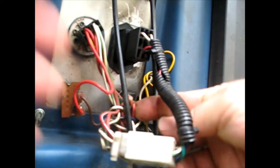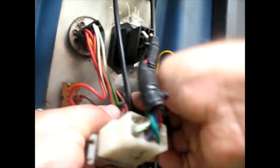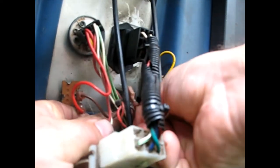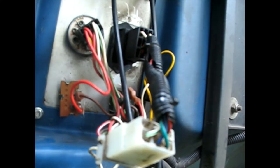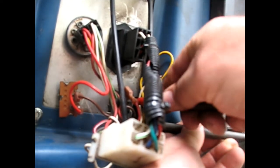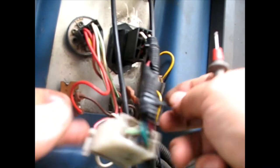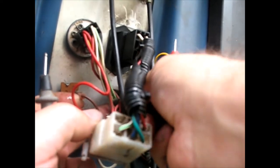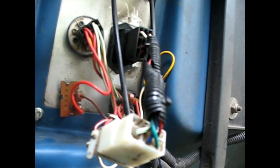There is a circuit breaker here - that's probably more for the charging circuit, but I'm going to see if we've got continuity just in case it is for the starting circuit. Testing across that - it'll beep if we have continuity, which we should if it's working right. Yes, I hear the beep. Okay, that rules out the breaker. Double check by cranking - nothing different.